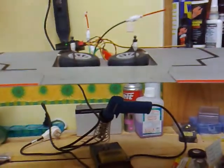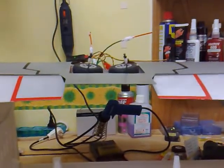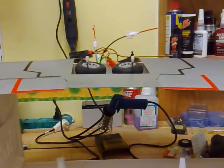The F-86 flap arrangement uses two servos, one for each side, with half flap and full flap positions. As you can see, the flap is nearly touching the dummy outboard tanks, giving plenty of angle to slow down.